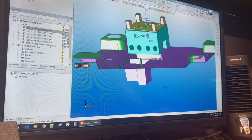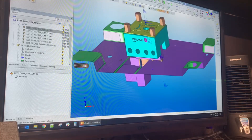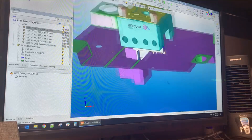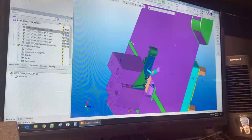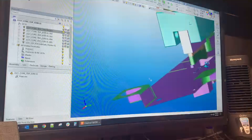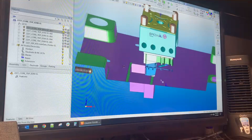There are five electrodes that were made to create the shapes that are going in here. I'm going to try to show you what this looks like on the screen before we do it in steel. We have the bottom cleared on our CAD model just so we can make sure we have the correct features that we're looking to put into the steel. That way we have a good idea that we're not going to have an error or a mistake — which, being in the shop, you know that never happens. Nobody ever makes mistakes.